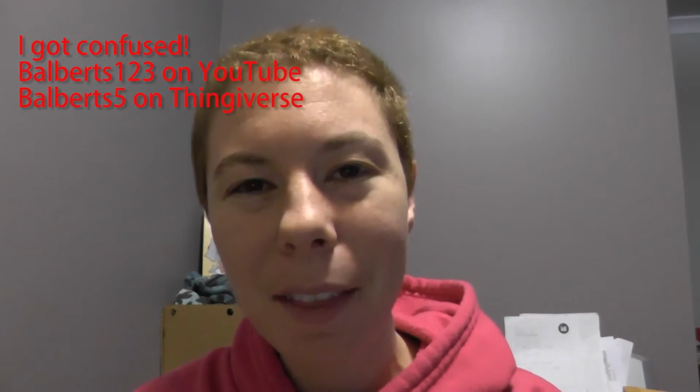Alright, so first of all, Balberts 5. Thanks for watching, mate, and thanks for contributing to the content of my show. I really appreciate it. So Balberts had asked me to print out his model, this one here, and I did this at 0.2 millimeter layers, 0% infill, and the only support was right at the bottom of the ball. So I was testing bridging, testing dimensions, and definitely testing to see how the ball would come out. Let's have a look at the print, shall we?